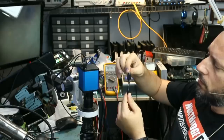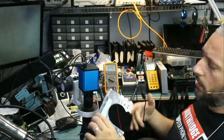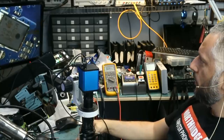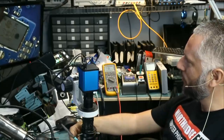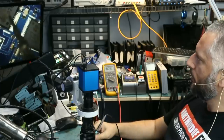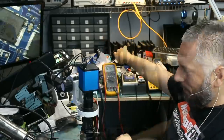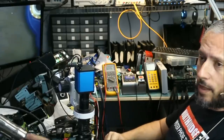We sell this laptop charging kit on our site and we are using the same one. Let's plug it in and measure here — 19 volts passing through. If we measure here on the first MOSFET — yes. So the problem is the adapter and not the motherboard. At the source of the first MOSFET — 18.58. At the source of the second MOSFET, the one we had the short on — 19.26. And if we measure the drain — 19.26. That's it, the job is done. The laptop is fixed. What are the chances that we had two bad adapters and had to try a third one to confirm the problem was the adapter?